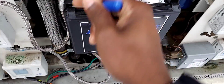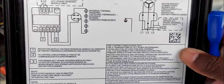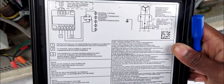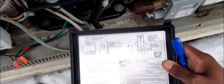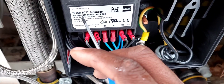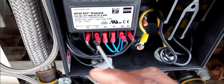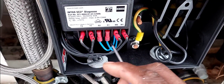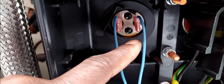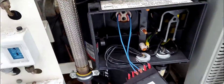Let's see what it looks like in the real world installed on the compressor. There it is - this compressor is running right now, it's currently online. There's a wiring diagram explaining what I just described. These two wires are the power supply at 24 volts, and these two blue wires here - that's the sensor.